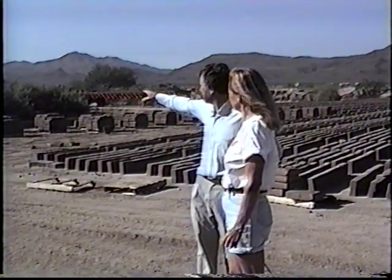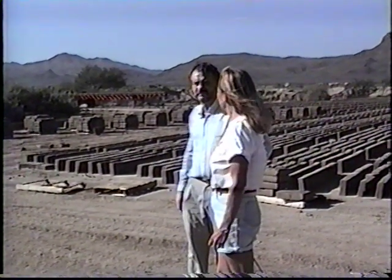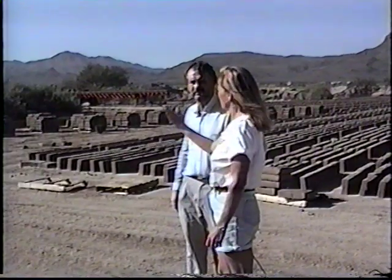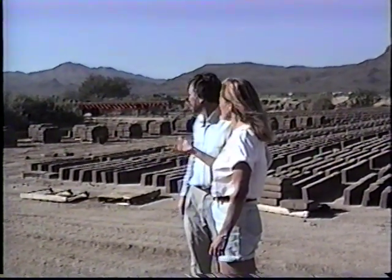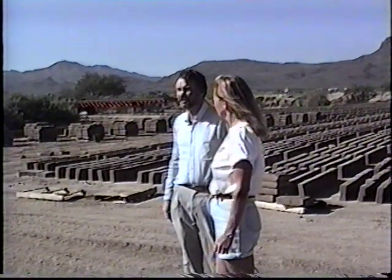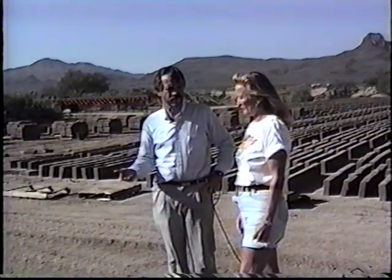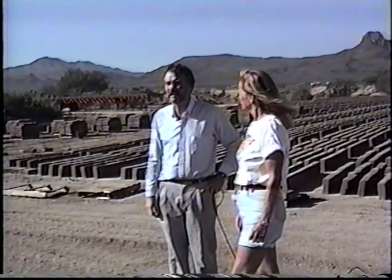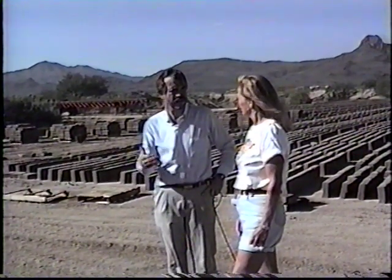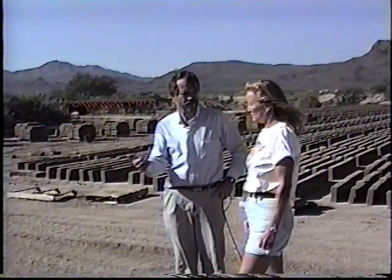And then these cans that we have here behind us, what kind of product was in those? Those are drums that will be filled to go out. You mix it with the mortar. It's the emulsion that stabilizes the mortar to match the adobe, waterproofer. Okay, so when we talk about the emulsion, that's the product that's added to the adobe to make it more waterproof. Right. Because a lot of people are worried about the fact that the adobe would fall apart in the rain. Again, that's a fallacy that will not happen with the emulsion products that are added to the adobe.